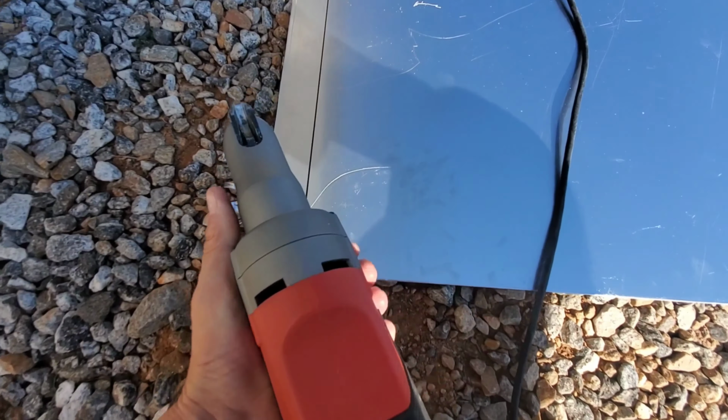But I'll tell you what, besides that, man, these things are safer, cleaner, more precise cut as far as the cleanliness of the cut than a circular saw. There's no turning back for me. And an added benefit of using the shears over a circular saw for aluminum cutting is that I get to save all of the scrap pieces. So when I accumulate enough of it, I could take a bunch of this to an aluminum recycler and actually sell it and get some money for it.